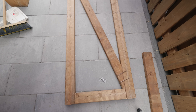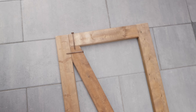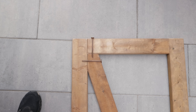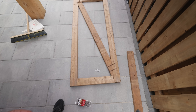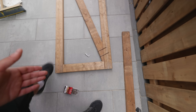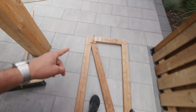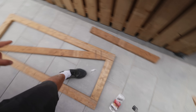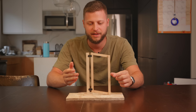I'm going to use four-and-a-half inch screws drilled in at an angle at both ends of the brace. Technically speaking, this brace should hold the door up by itself without fasteners, because it's the wood doing all the work through compression. You really only need one or two screws just to hold it in place — it's not the fasteners doing the holding.